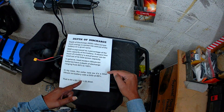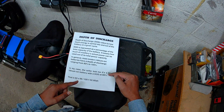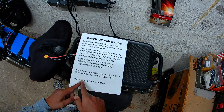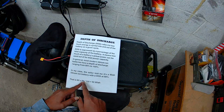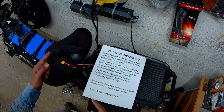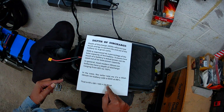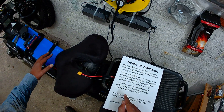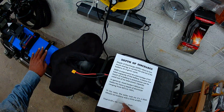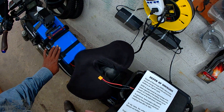In my case, this is a 60 amp hour lithium-ion battery with a depth of discharge of 88%. That means 88% of 60 amp hours equals 52.8 amp hours of usable capacity. So when I charge it, it should take 52.8 amp hours. If it takes 52.8, it's a legit battery. If it takes less than that, it's not legitimate.